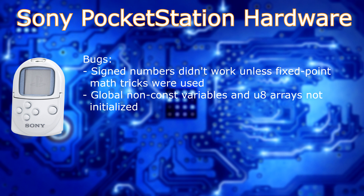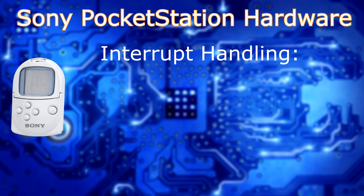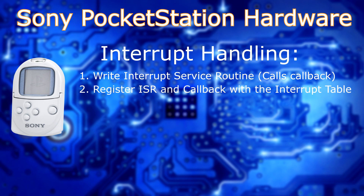2K of RAM is plenty of room for most of these operations. The Pocket Station also had a clock peripheral in binary coded decimal. The button interrupts were hooked up directly to the ARM chip — GPIO pins had to be set as inputs for these button interrupts to fire, and the button memory is configured around the GPIO pins connected to them in the schematic. There was a process you had to go through for these interrupts to be fired, very typical of embedded systems, and the Cortex-M uses a pretty similar system now. The idea was to write an interrupt handler or a function callback inside your C code, so when that interrupt fires, that's where it points in memory. You had to register it in the system interrupt table. New Cortex-M devices generally have nested vector interrupt controllers that prioritize interrupts based on what you set in software, and you can register the callbacks based on that interrupt table. But in this case there is no vectored interrupt controller, so it's basically one-by-one execution.